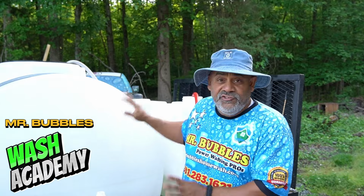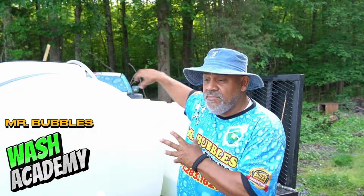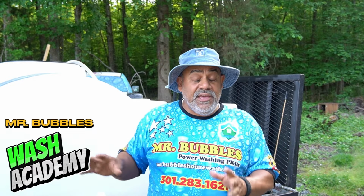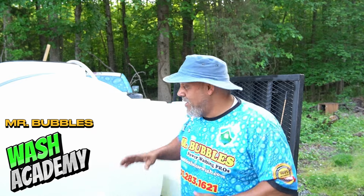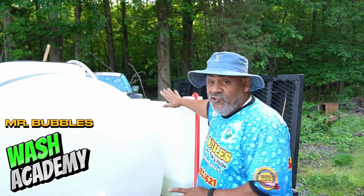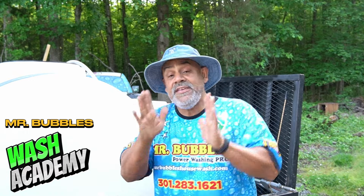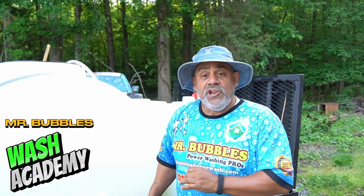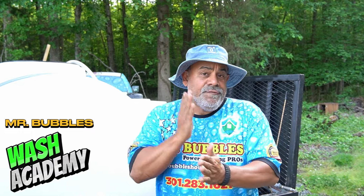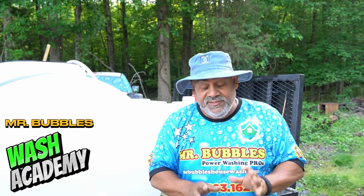Now, on this truck, I have a roof pump and a metering system, and I can transfer chemicals as needed. But of course, you guys starting out, you're not going to have that. 98, 99% of you guys are going to be batch mixing, and that's how you're going to do it, guys. 50-50 mix, half water, half bleach, and then you're going to put one cup of surfactant for every 10 gallons of mixture. And then the final thing I'm going to leave you with is this.